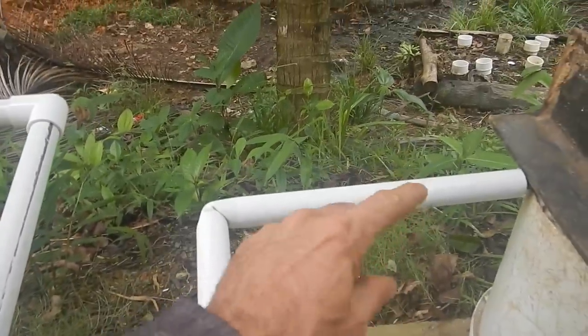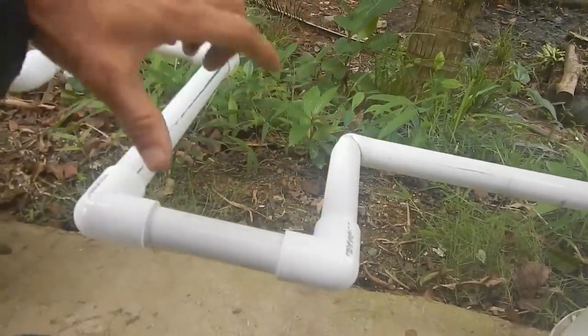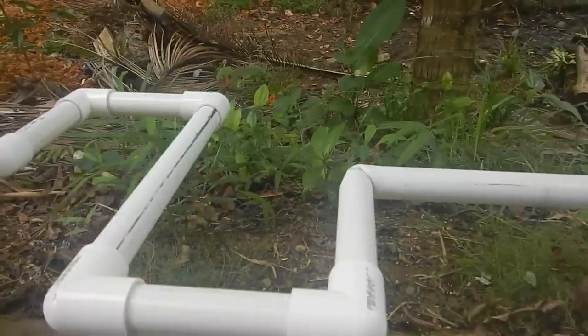Here's how it basically goes. I cut that into pieces that will fit, like wrap around here, and then some pieces that will wrap around here, and then here, and I'll just keep going through the whole thing until I have pieces that will fit on every part. And then I'll go get a gallon of polyester resin I have right over there. Mix it up with its hardener, use a roller, and just start putting those fiberglass rectangles on there. It sounds so simple, and I'm gonna try not to make a mess.